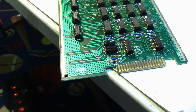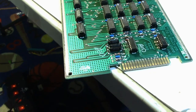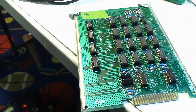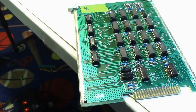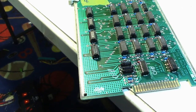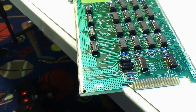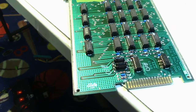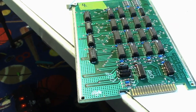Okay, here's the rundown. When I started, I had replaced U4, and then it said U7 was bad. I replaced U7, then it said U9 was bad. So I replaced U9, and it said U11 was bad. But after replacing U9, the picture did clear up a little bit, and it got a little better. But it stayed the same until the last chip.